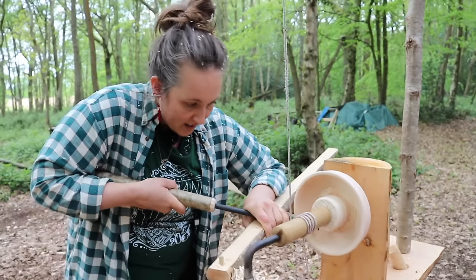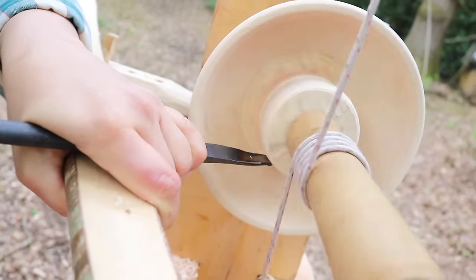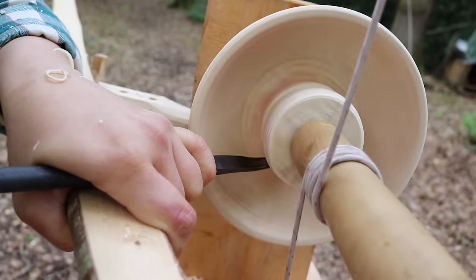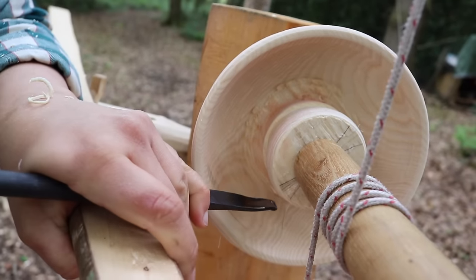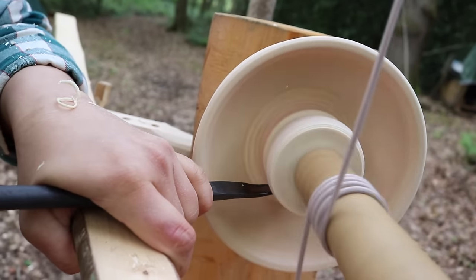And as I slowly turn the cutting edge in, I'm able to, like everywhere else, establish a little shoulder that I push down. So my tool is going, I'm barely changing the angle, just enough to stay engaged with the wood.